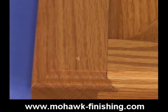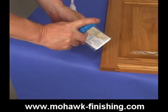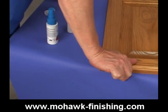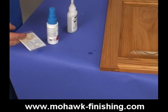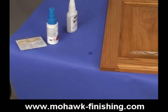CA glue can also be used to fix splinters. Apply the CA glue to the splinter or the substrate. Spray some activator very lightly on the surface around the joint, or as we've done here, on a scraper card. Use the card to hold the splinter in place. The goal is to instantly cure the edge of the repair so the edge will hold the piece in place while the center of the contact area dries a bit more slowly, making an extremely tight bond.